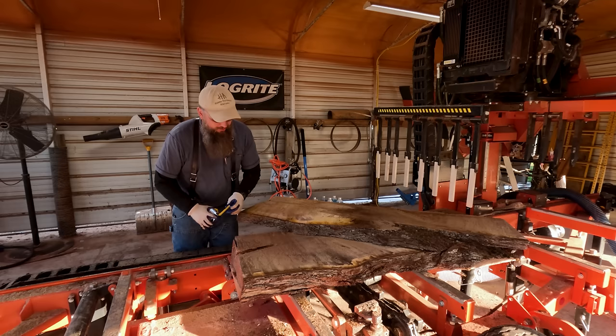This right here I thought was a good question. This is from a Patreon member, and he asked me, what tool do you have at your sawmill that you use all the time, but you rarely show on camera? That's an easy one, but you guys hardly ever see this. Right there it is, friends, an air compressor. I use this at the sawmill all day long. I rarely show it on camera because it's not too exciting, but it has a whole lot of different purposes here. Cleans me up at the end of the day. It also cleans off the blade guide rollers better than anything when you're getting the dust off at the end of the day. I also use this to dust off the engine and the bed rails and pretty much all the components of the sawmill off camera.